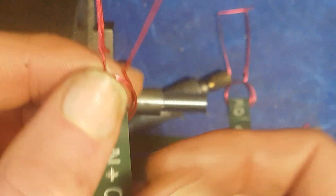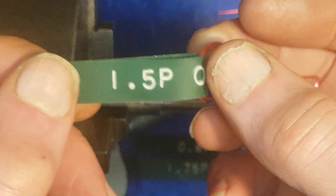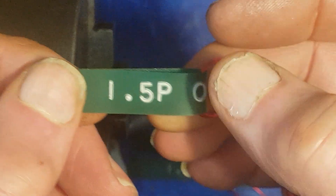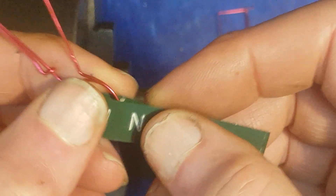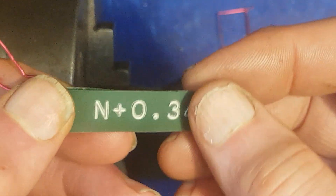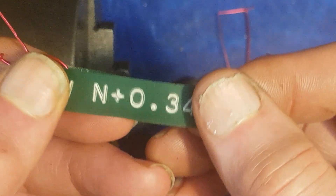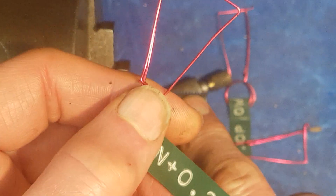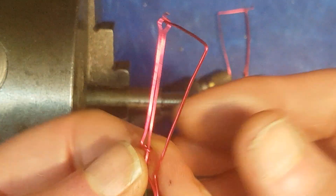This particular set is intended for 1.5mm pitch threads. It doesn't matter what the diameter is because it's the thread depth that matters, and in this case with a 1.5 pitch thread you have the nominal plus 0.34 millimeters. So in this case with a 10mm thread here it should read 10.34 over the wires.